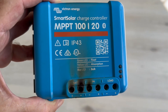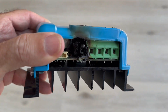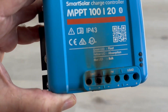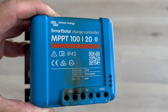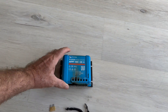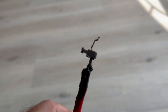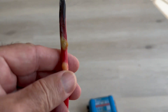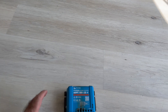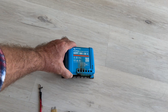Thank God this didn't cause any more of a problem because the inverter sits above this on my setup. I mean it freaking burned. Thank God I was checking my wattage this morning — it seemed awful low and when I went into my little control room you could smell it. It burned right through these screws. Here's your positive from this guy — fused to the screw, absolutely destroyed on the interior and melted down through the wire. It even melted a little bit of the Victron data cable that plugs in here to that little white outlet. I'll have to replace that too.